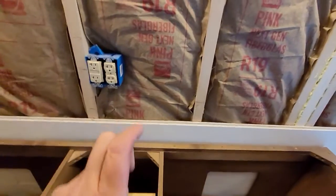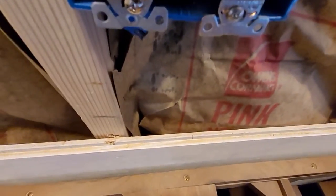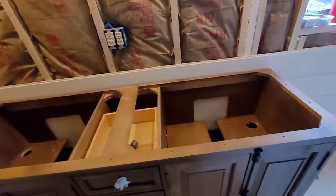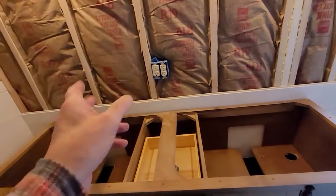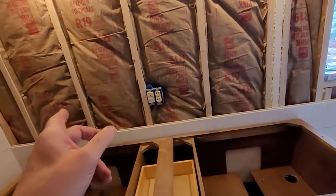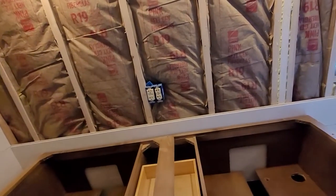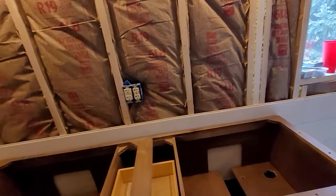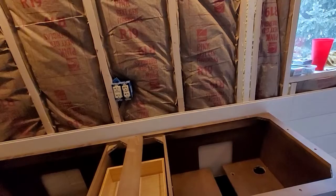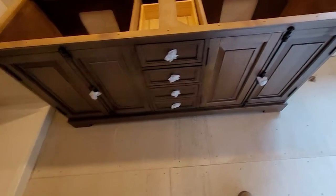Like I said, it's a backsplash. It's quartz. If you go to push it, see the gap in here? There's a gap all the way across, about 3/8 of an inch. It's quite a bit. That's pretty big. So I might have to do 1/4, 3/8, 3/8, 1/4. That's how I may have to do it with the spacing. Just put a piece of wood over the top of that just to square up, put the level back on. I'll bring my 6-footer up. That's what this is. This is 6 foot.